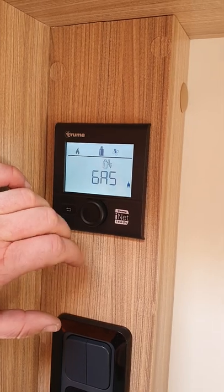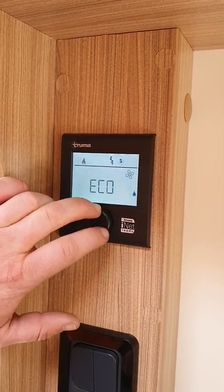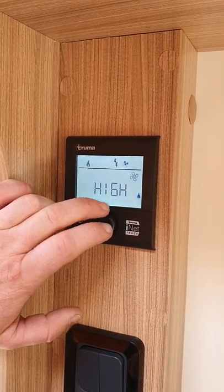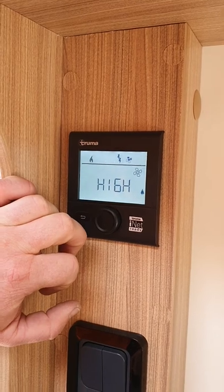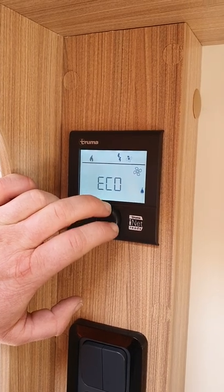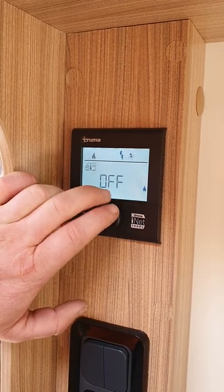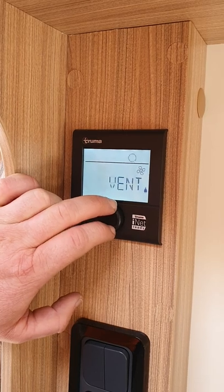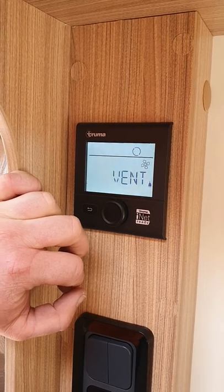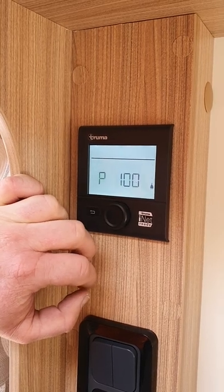Go back to E2 for now. At the far end is your fan function — you have eco and high, which are purely for the fan that circulates air around the room through the ducts. If you turn the room heater off and go back to the fan, it gives you a vent option that circulates room-temperature air for a mild cooling effect, though it's not a chilled air function.